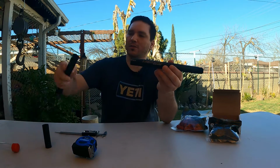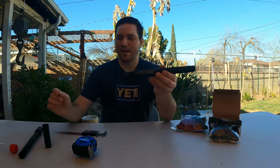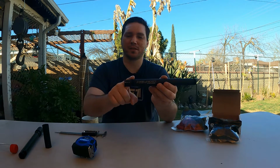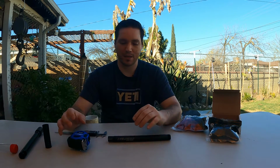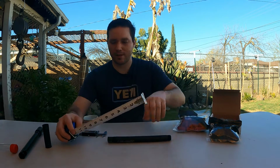And you got to remember, if you're running a T15, you're going to need the adapter to go to this style connector with these grooves that are cut out on here. And that's going to be about 2.5 inches or whatnot. So you'll have 2.5 inches on here, but remember, it's going to thread onto the barrel. So this will take up about 1.25 inches, so this will take about 1.25 inches off of the total length of the adapter. So instead of say 2.5, you're going to be looking at like 1.5 or a little less than 1.5. Okay. And then you got 5/8 thread here when we screw all this together.